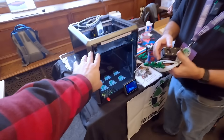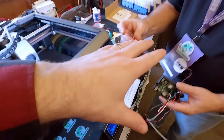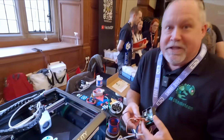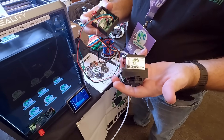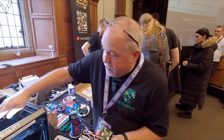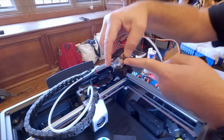Because we're not mucking with the firmware on the actual printer, that limit switch is what triggers the system. By the print head hitting the switch, it tells the Chameleon to do whatever it needs to do — there's a whole sequence of commands that get entered. It also gives you audible feedback; you can actually feel it when it's switching commands, which is kind of cool. One other thing we have optionally is an automatic filament cutter. Bambu came out with their filament cutter on their machines at the print head, so I decided to make an open source version of that, completely automated.